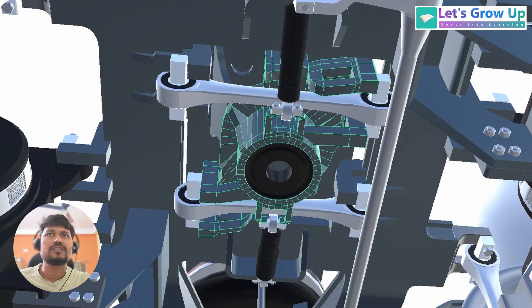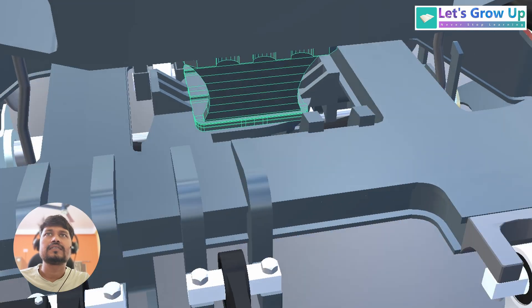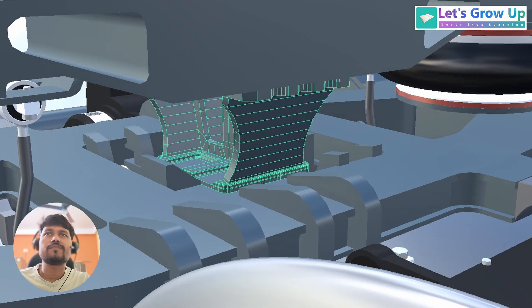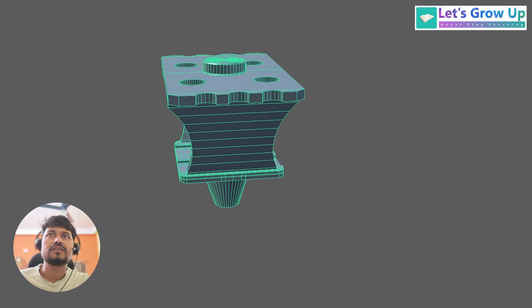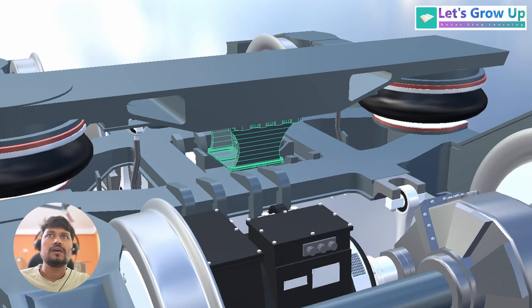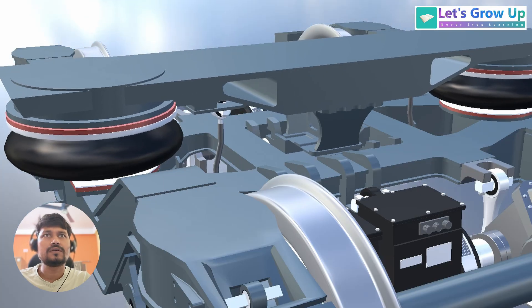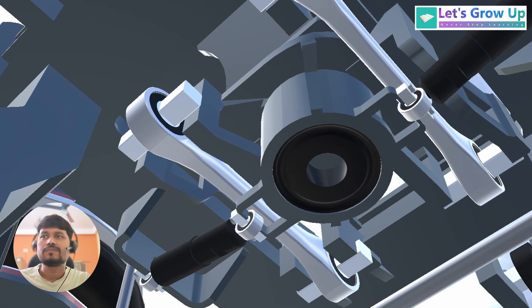You can see both the top of the traction center — this is the traction center base — and here you will see the traction center pivot pin. In this way the traction center absorbs different kinds of forces, and along with this, both side air springs also work during operation.